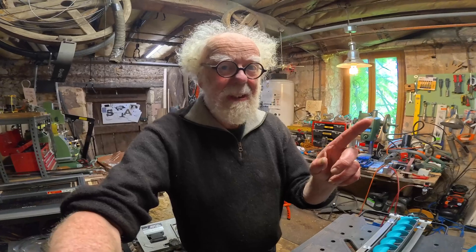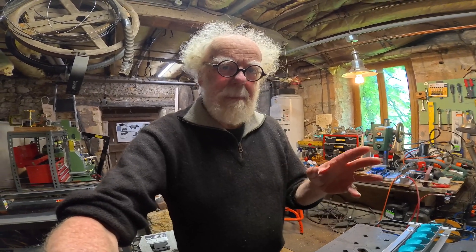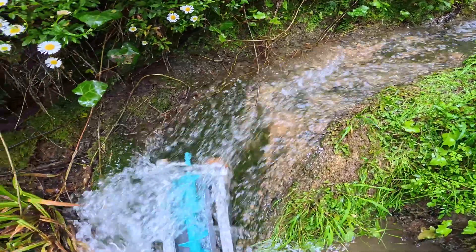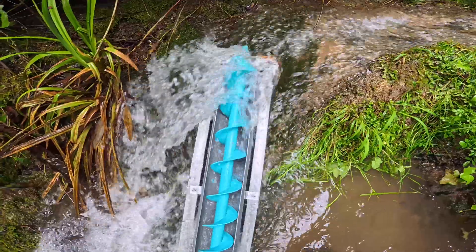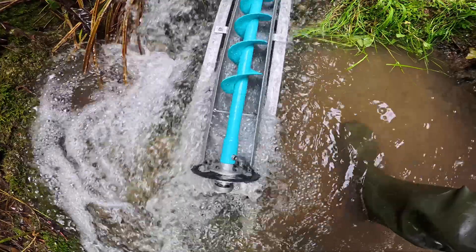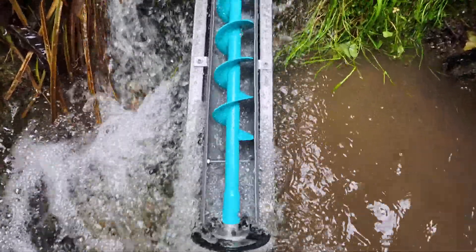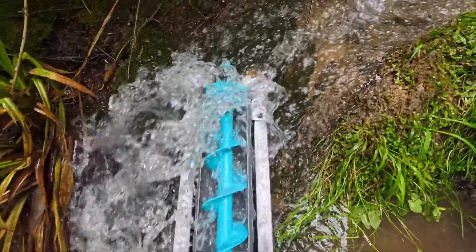Let's go and try it in the water, and you'll see what I mean. The water tries to enter the top end of the screw and a lot of it just splashes off. It needs some way of channeling the water in, in higher quantity, down the channel, and then at the egress — the outflow — it's blocked by that big cog.